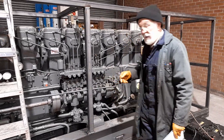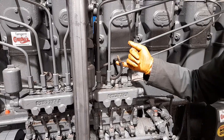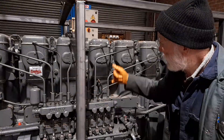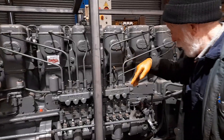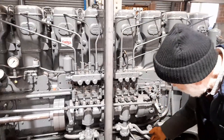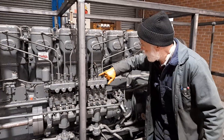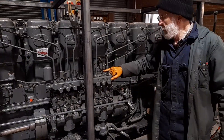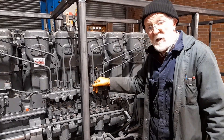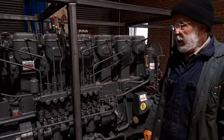This particular engine has a very interesting feature — I refer to these as telltales. My understanding is that if these unions here are in any way loose, the diesel will leak here, and on a complete engine it's drained off down through this pipe and into a container. At any point in time you can check that container and know whether those unions are all tight. You'll see one here has been replaced and doesn't have a telltale on it. This engine is going to a customer of ours in America and I may suggest he fits these telltales or just welds that up, since it's not a commercial vessel.